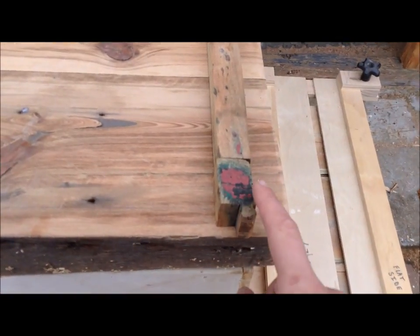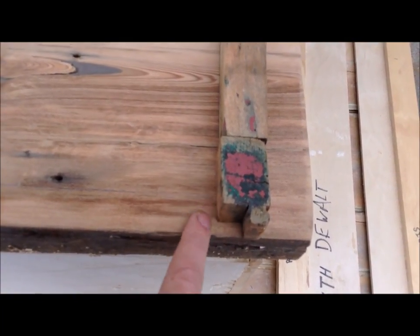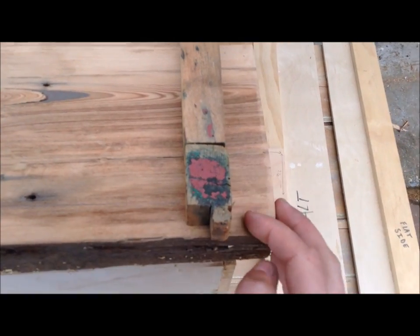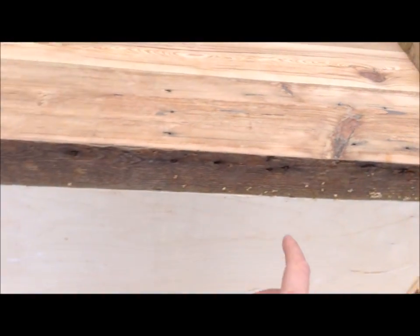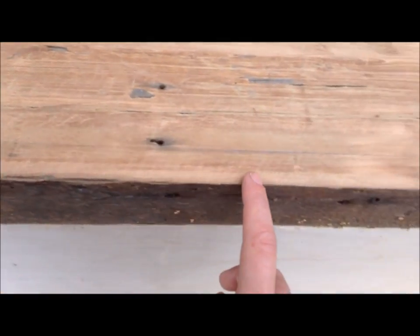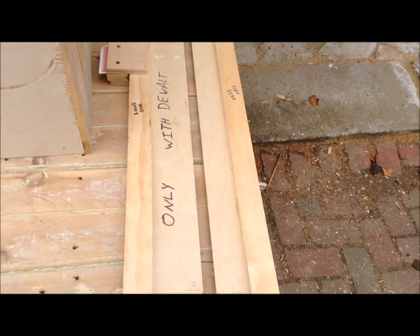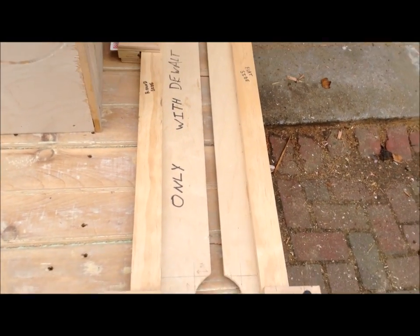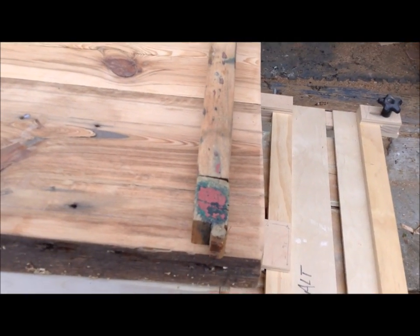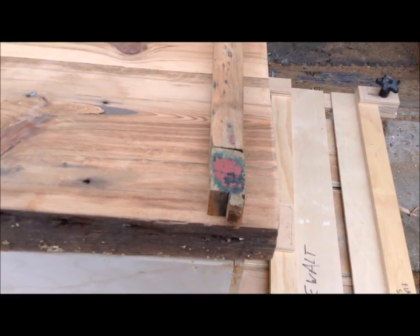You can see I have those bottom pieces lined up with the rabbet in the back. You can see how the backer will be rabbeted into place - it's going to go about 13 inches up, and it's a little over an inch wide. Those are the dados I'm going to cut, evenly spaced across the back of this cabinet. This is the groove I'm going to route out of the back for that backer. To cut these dados I'm using a jig I made about a year and a half ago - it works great and I have a video on my channel on how to use it. I'm going to get the dados about an inch and a half deep using a down spiral bit in my router.